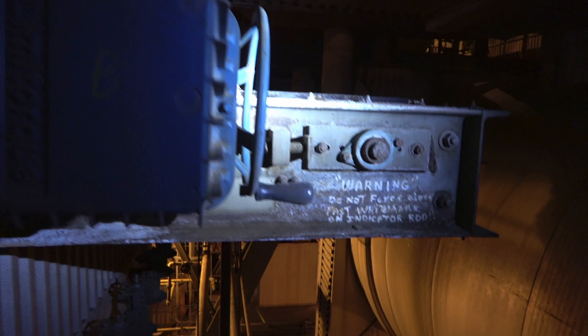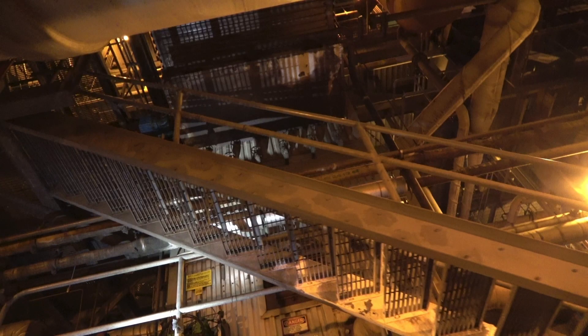This is the other damper — the first damper coming in is the guillotine. It's actually a plate in here driven by a limit torque motor — a big steel plate that drives in to shut the air off. So there are three sets of dampers on this style: the guillotine, flow control, and then the primary air shutoff. There's a warning that says do not force — this is a case where more force isn't better. Up here is the guillotine, flow control, and the primary shutoff sits right below that.